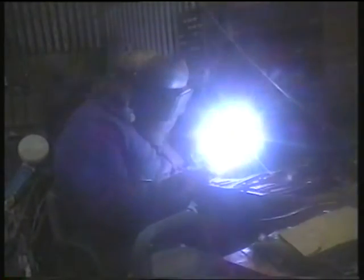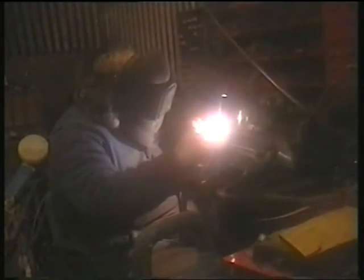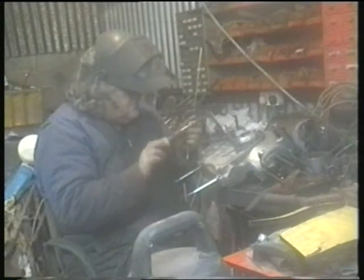This makes it easier to keep everything in alignment and requires less machining at the end. I try to concentrate the arc on the aluminium rather than on the stainless, more or less letting the molten aluminium roll over the stainless mandrel. Keeping everything clean is especially important with these cases as they seem to be absolutely soaked with oil.